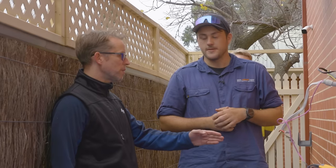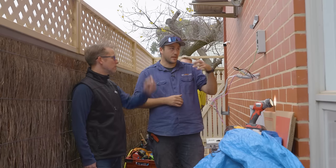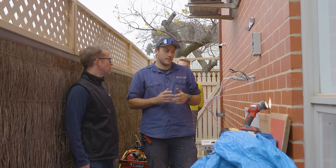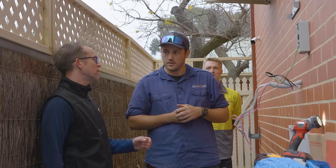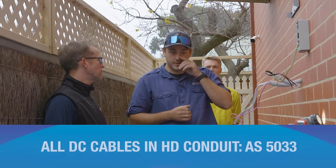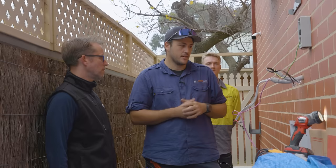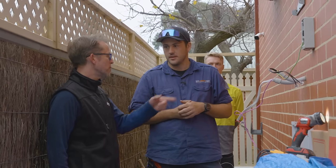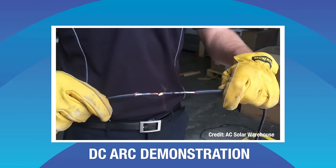This is a DC coupled battery, so the power wires are DC going from the battery to the inverter, connecting straight in with the PV array. There are special rules about running DC cable: inside buildings it must be run in heavy duty conduit for safety and segregation from AC services. You don't want anyone putting a drill through a DC cable, especially under load — it'll give you a bit of a lightning bolt in front of you.